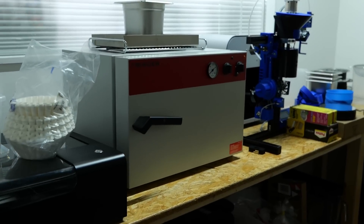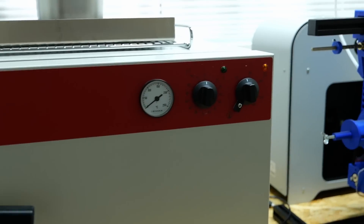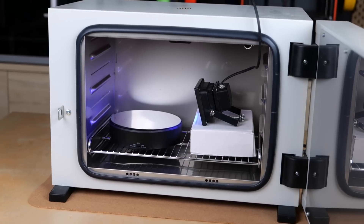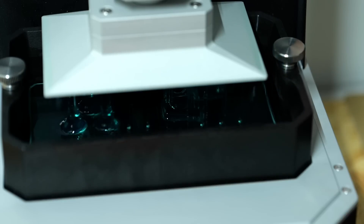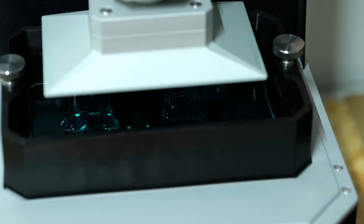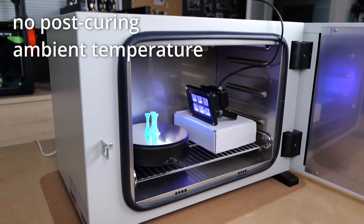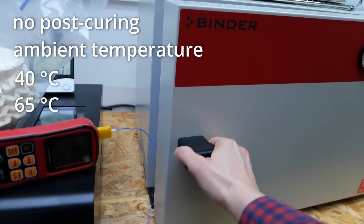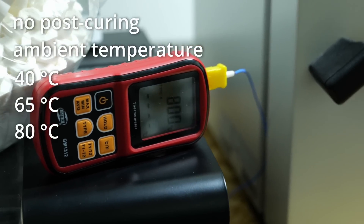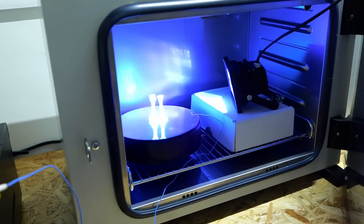I looked around my studio and realized that I have a precision drying oven that not only goes all the way up to over 200 degrees Celsius but was big enough to fit a UV curing light and a battery-powered turntable. So I printed another set of samples and prepared five more tests: no post-curing, curing at ambient temperatures with an open door, then curing at 40°C, 65°C, and finally 80°C. I would have loved to go even higher, yet I wasn't sure how happy the LED light and the turntable would have been.